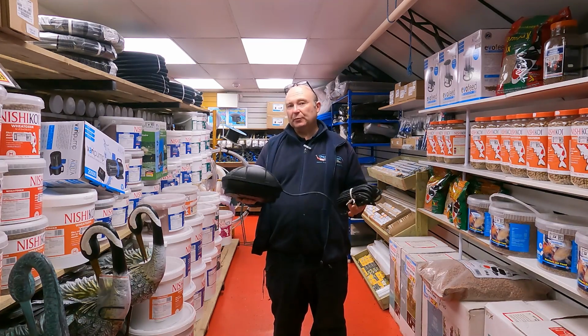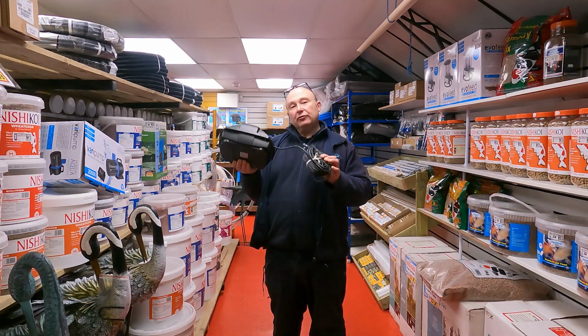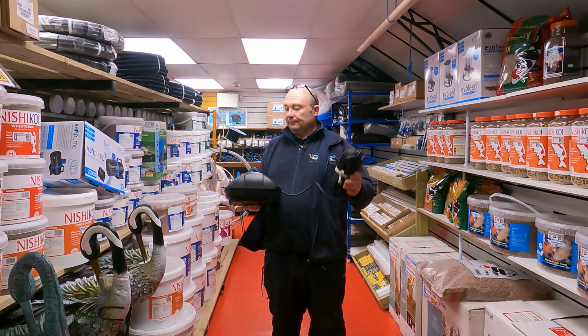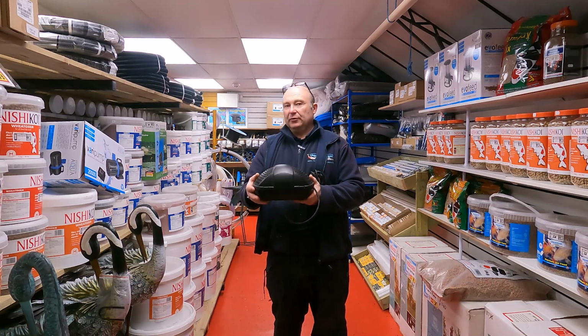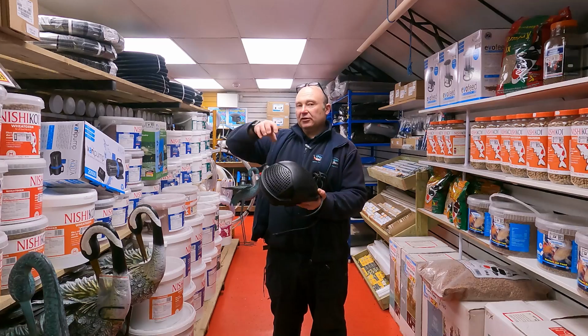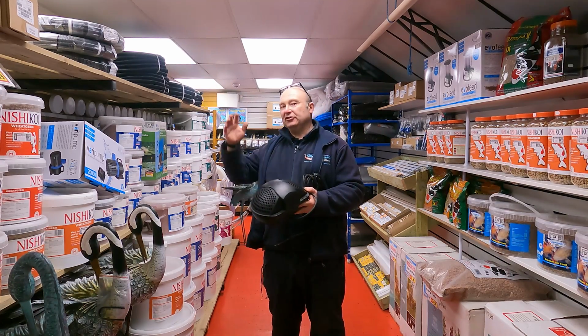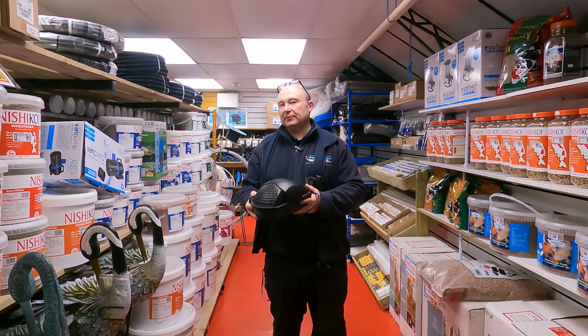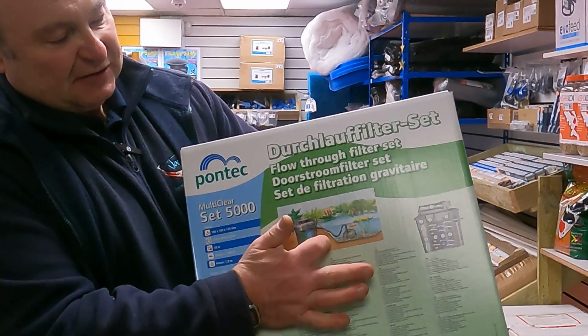It's a submersible pump. Incredibly easy to use. They generally come with 10 meters of cable and they'll have a protective basket around the pump. Onto that you're going to connect a hose tail, a short section of pipe, and that's going to feed your filtration system with water. There's a really good drawing of what I'm on about on the side of this box.